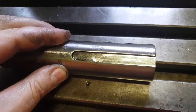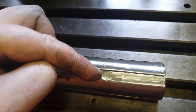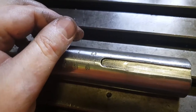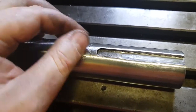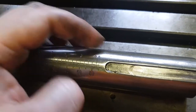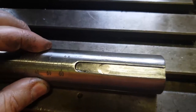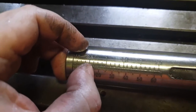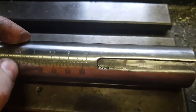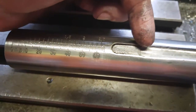I was afraid this might be hardened steel. Back at this end, the file certainly touched it, but as I got deeper and deeper in, there was a very sudden change around about here and the cutter just wouldn't cut. I think it probably needs carbide to cut this. But it's not actually a problem — this is Morse Taper 3, and when I've got a taper in here, the quill basically can't retract less than around 16mm into the tailstock. The hardened spot is actually closer to 12-14mm in, which is where this divot is.